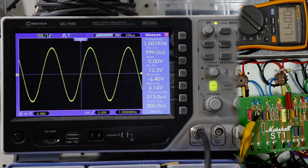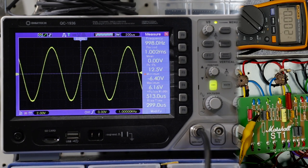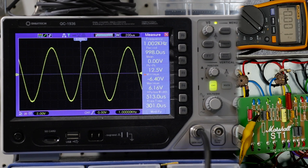And the other thing I want to show is what's happening on the scope. Okay, where I've got the probe connected is right after this first gain stage, right? So in the 2203, after the first gain stage, it passes through the coupling cap and heads over straight to the gain pot. I'm measuring this at the entry to that gain pot, and you can see my peak to peak voltage here is 12.5 volts. So I've got actually a 200 millivolt, 1K sine wave coming into the front of the amp, it's in the high input, and with the 100K plate resistor there, I'm getting 12.5 volts peak to peak after that first triode.